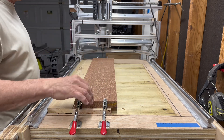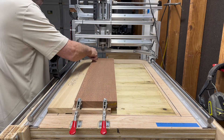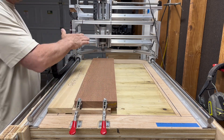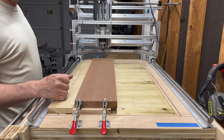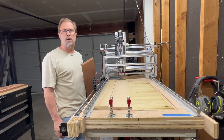If it's in the middle, when you flip and do the other side you should definitely be right on. Make sure it's not racked from here to here — if you do that, you can easily mill the other side and be dead center. I thought I'd share that because it really helped me. I built this jig specifically for guitars for repeatability, so I can set it on there the same way every time. I hope this video helps you — subscribe, I'd appreciate it, and thanks for watching.